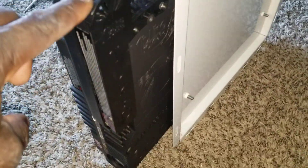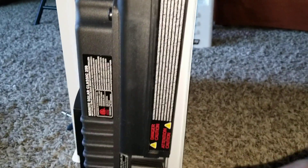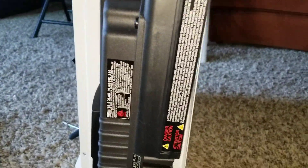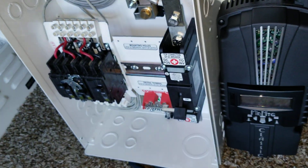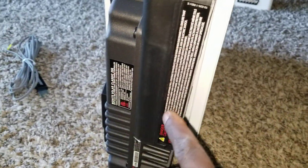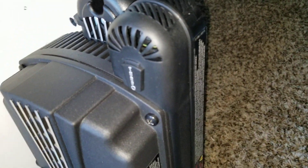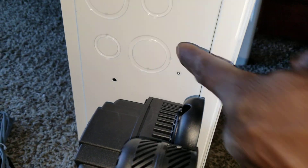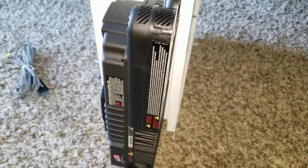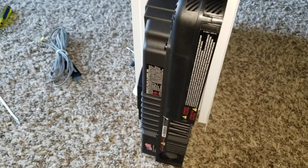More clearance here. The reason why I didn't mount it on the other side — you want to mount your charge controller on the right-hand side of the box. Doing so, you can help the MOSFETs, because all the MOSFETs are here. That's why they put a turbo fan on this side. This is a heat sink, and here is a cooling system which is the turbo fan. You don't want to place this on the wall of the MMP 250 because it's not going to dissipate the heat well.